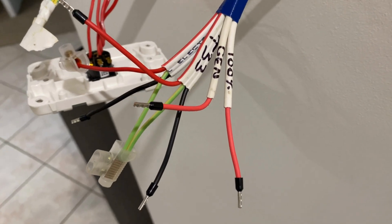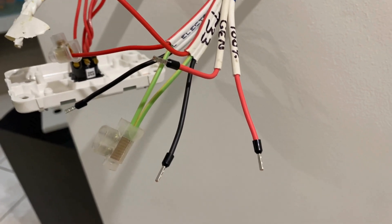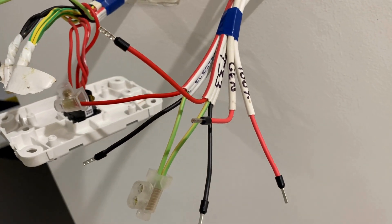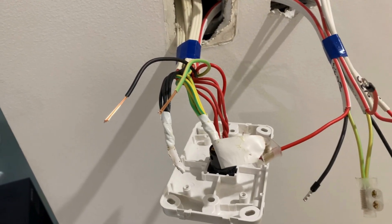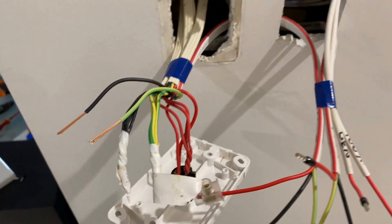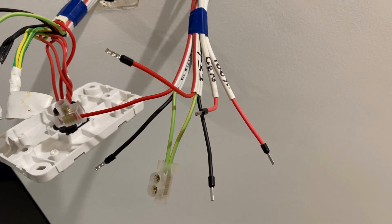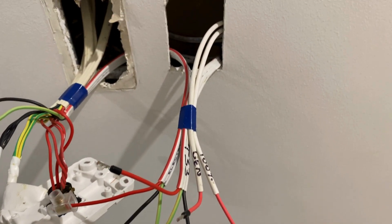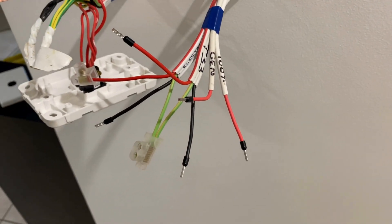I've labelled all the cables, stripped off the ends and terminated them with boot lace ferrules. Now they're ready to go into those indicators. I've got the neutral to terminate on this side. Once I isolate that lighting circuit, these cables will need to be pulled into the switchboards down the other end and terminated. I'll get these fixed off into those indicators now.